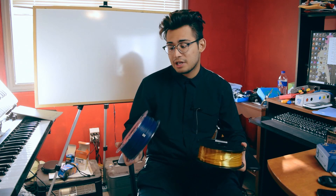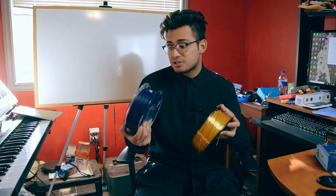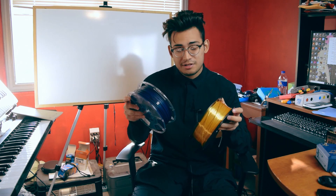Obviously you're going to need 3D printer filament. This here is PLA, which I prefer because it's super easy to print with and supposedly somewhat biodegradable. The biggest downside to PLA is that it's not very heat resistant — it can actually get soft on a really hot day in direct sunlight. There are other materials that address this: PETG, ABS, nylons, and even some PLA variants with high temperature resistance. I've never had an issue with PLA's temperature resistance personally, so I've been using ESUN's PLA Plus, which is a bit more impact resistant than normal PLA and generally better for functional parts.